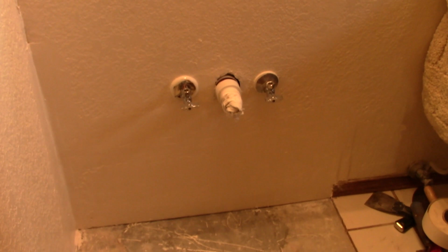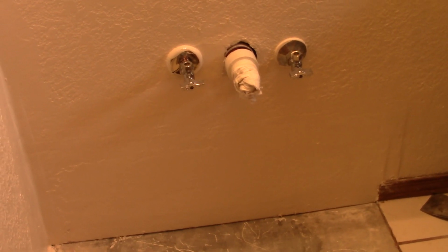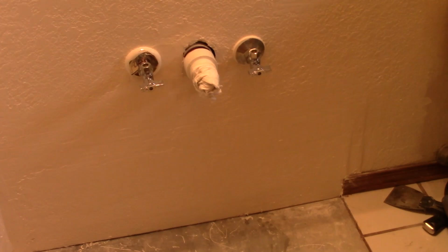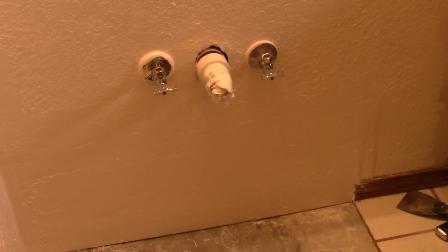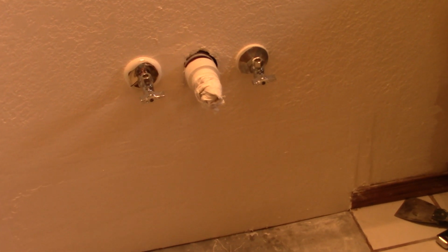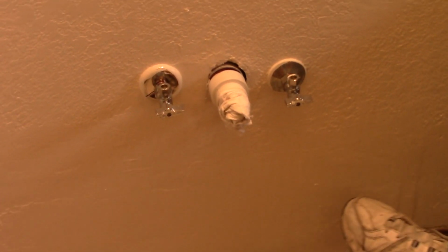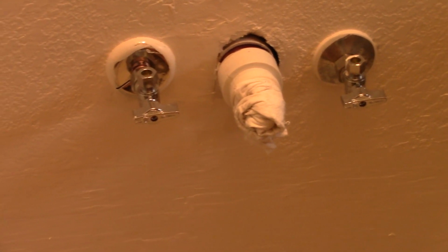Okay, tell me about what you did yesterday to finish. What I did yesterday is basically put this board in, this drywall. Put it in with drywall screws. Made a frame for it so I'd have something to screw it down to. Screwed down the plate, scab it to the studs, right? Exactly. And then put it in the plate, cut it to size, put it in, screwed it down, made everything tight.